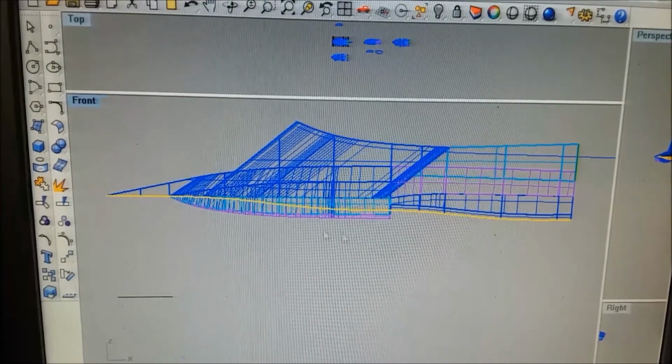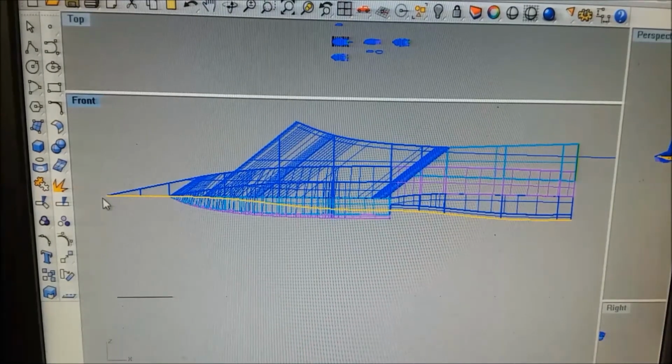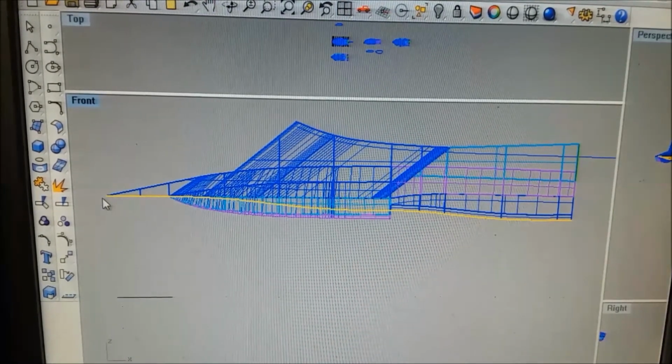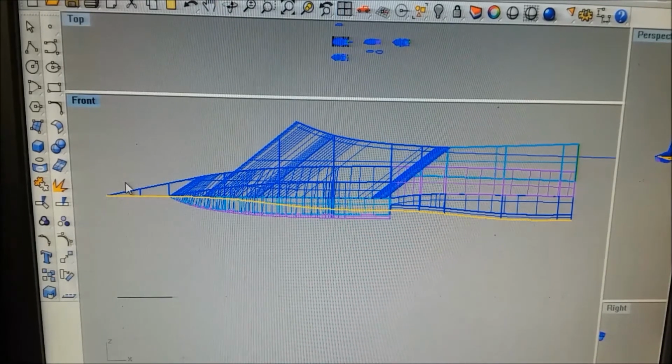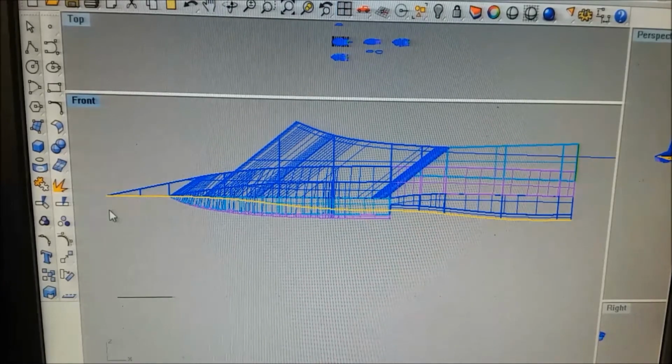This is actually not a line. This is the bottom surface of the boat. This is built like a stitch and glue boat or anything that's built out of flat materials like plywood, steel, aluminum, anything that doesn't take compound curves. It's not stretchy at all. This boat here is designed to be built out of 1/8" stainless. Could be built out of 3/16 A36 plate just as easy. It would weigh more, but easier to fabricate. You don't need a plasma cutter to cut it.